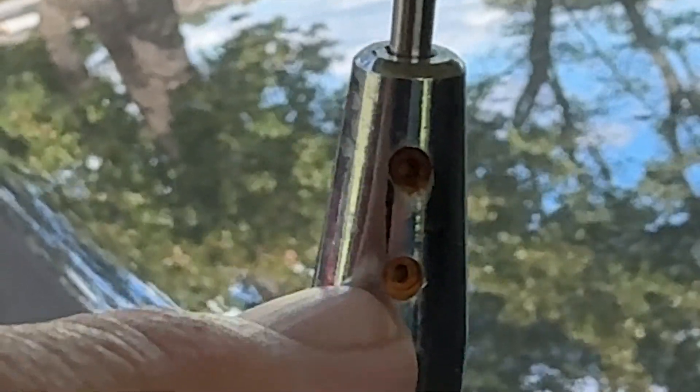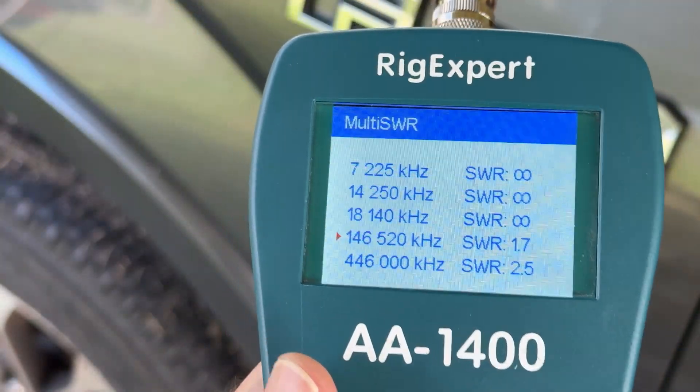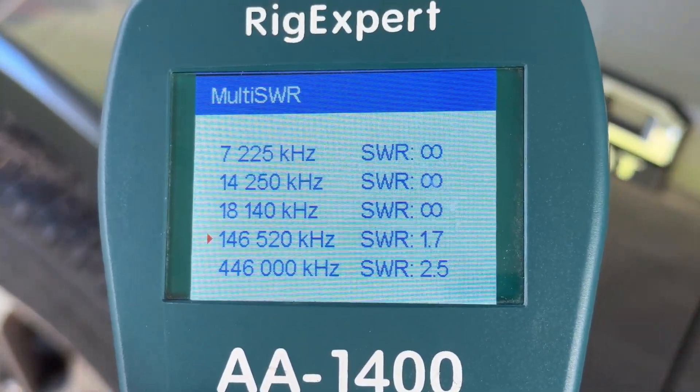So today I want to share with you the setup I've got here. I have not tuned this antenna since I put it in the truck, and today we're going to do that. I'm going to handhold this part. So on almost all of these mobile antennas, you're going to have some set of set screws, and what those set screws allow you to do is raise this up and down to get the best tune on your antenna. I'd also point out that these look a little rusty, and after I get done tuning it, I'm going to tighten these back down and put a little bit of petroleum jelly in there to keep the rust out. I'm using a Rig Expert here — you can use a Nano VNA — but I like a Rig Expert.